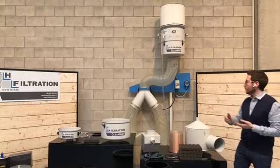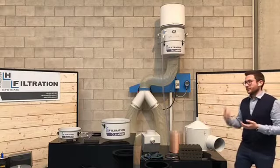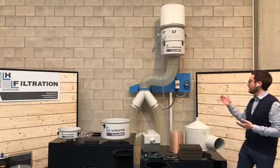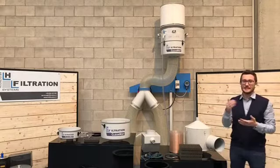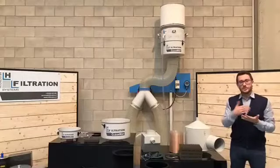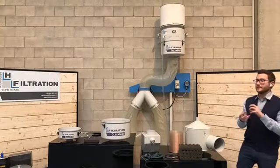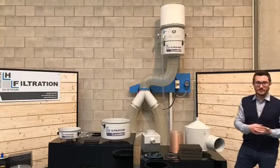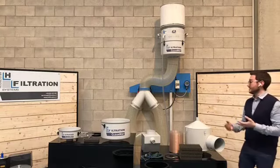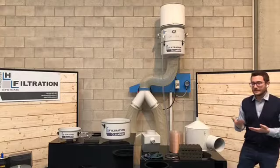One thing that obviously also can happen with the cartridge, with the final filter. For the final filter, we can have the accessory, of course, of the differential pressure, where you can see that the pressure is changing. So if the pressure is going up, it means that the filter is getting clogged. So you will have a decreasing of the performance of the filter. It means that you should change and you should do some maintenance.